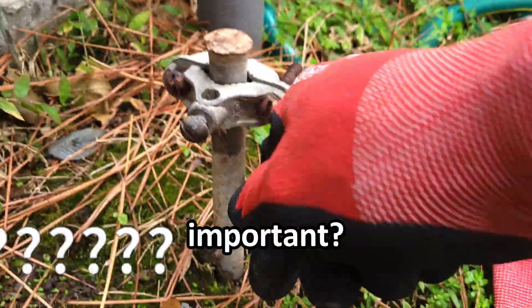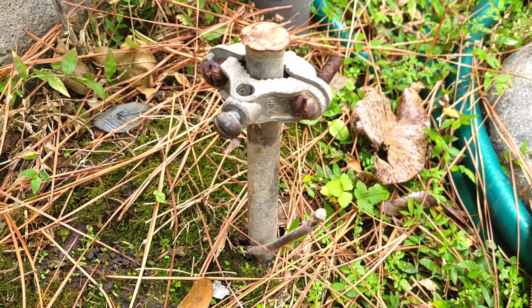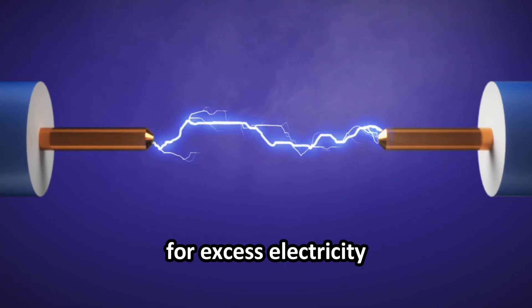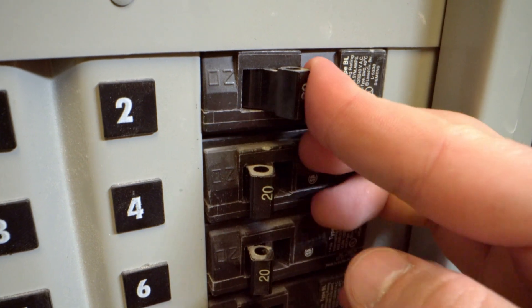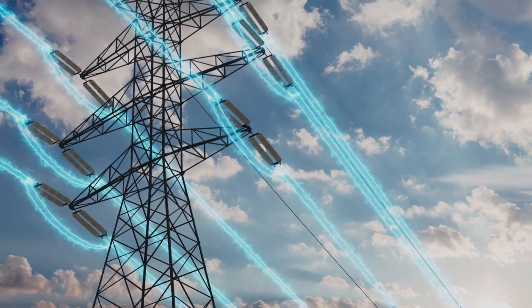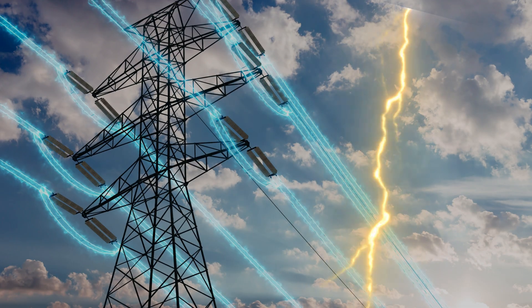You're probably wondering how important is this ground rod and what's it for? The main purpose is to create a low resistance pathway for excess electricity to enter the earth instead of things in your home. But it doesn't directly itself trip the breaker. Also, it helps in the event of a power surge or even a lightning strike. But lightning's unpredictable, so we never know.